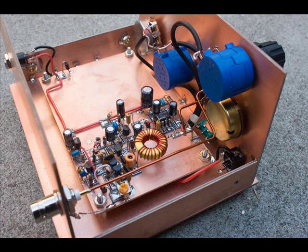You'll notice that as well as the main tuning control, the regeneration control is a wire-wound — a multi-turn wire-wound, by the way. That wasn't in the original plan. You don't have to use that. The original design uses a cheaper regular 10k carbon part, and then there's a 10k preset used just to set the general area where regeneration occurs. But I had an extra wire-wound hanging around and wanted a reason to use them, because the regeneration is just beautiful with the wire-wound. It's really smooth. It's just great.